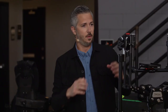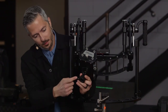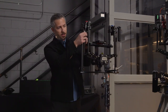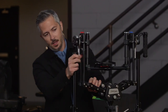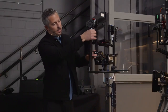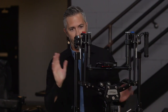It's built. Going over just the basic anatomy: there's a roll axis, a tilt axis, and down here there's a pan axis — it's a three-axis system. I'm going to lock everything off. There are these hard plunger locks that shut down whatever axis you're dealing with. It's on a spring: when it's depressed, it's in a locked position; to open it, you pull it out and turn it 90 degrees, and now it's free and open. I'm going to lock the tilt and lock the roll.